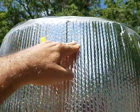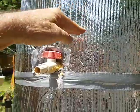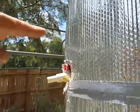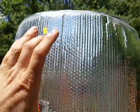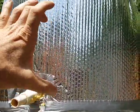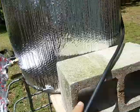We know it's going to heat over the day and with only one panel we may heat about half the barrel, so we should still have hot water with one panel. When we take water out, the level is going to drop. If we don't turn off the incoming hose, as the level drops the float will go down and let more cold water in at the bottom, which pushes it up. Generally, if we don't have too fast a rate coming in, we can be drawing out hot water while cold water continues to fall down through the panel.